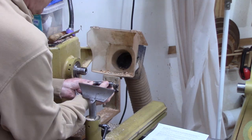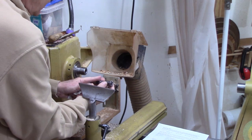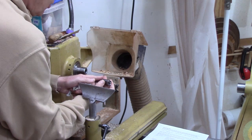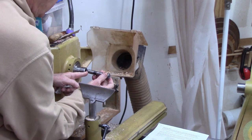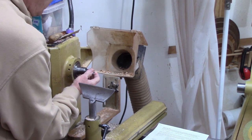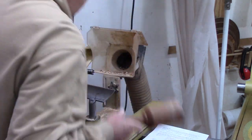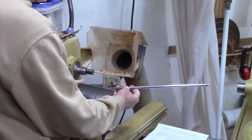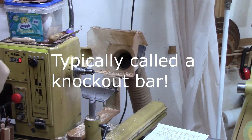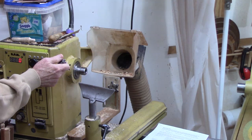How do these things work? They work because the surface is so carefully and precisely machined to match the male cone with the female that it gives you a lot of surface friction once you make sure it's clean — that's why it's so important to clean these. When you pop it in place it has a lot of friction. Sometimes it doesn't hurt to tap it just a little bit to secure it. To remove it you need an ejecting bar, and sometimes you have to pop it pretty good. Be careful when you catch it that you're not sending it across the room.